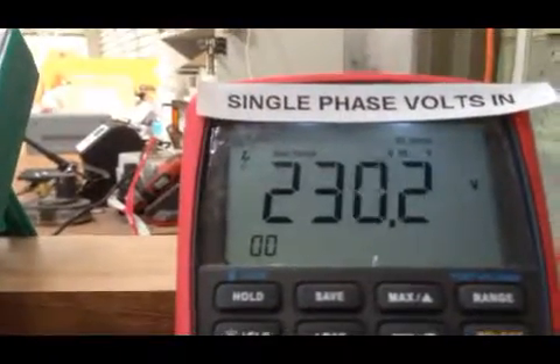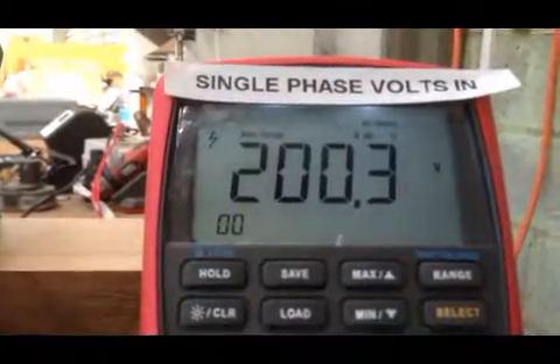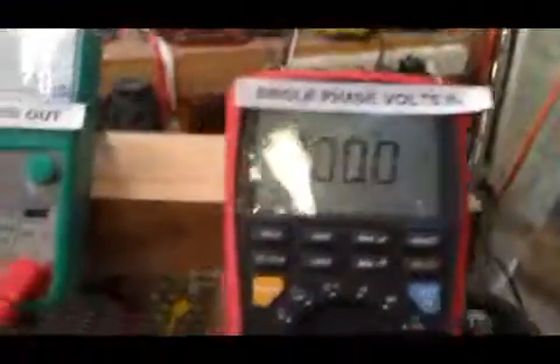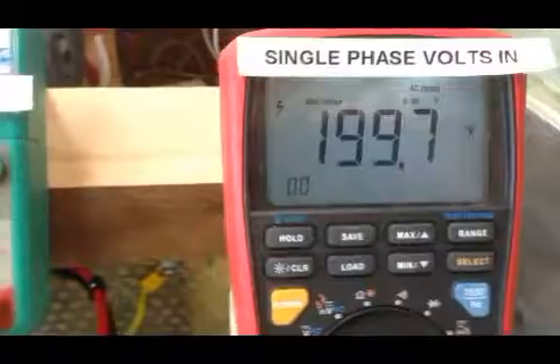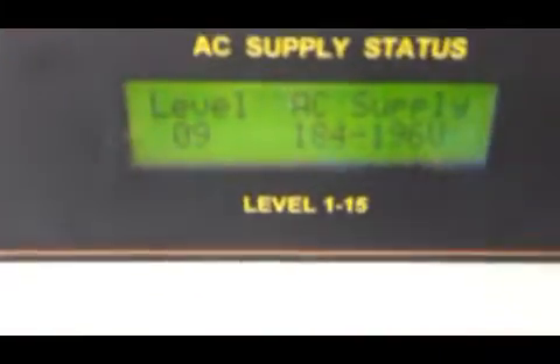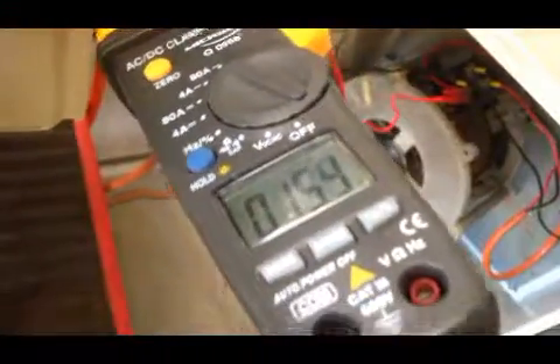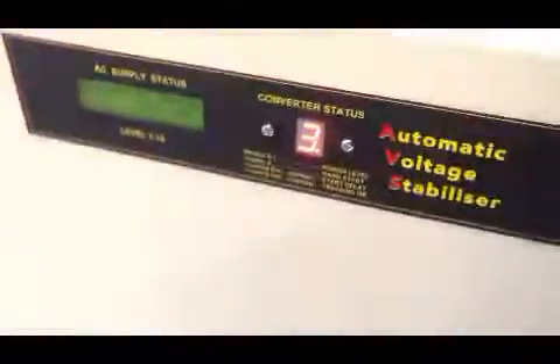Now I'm going to bring the voltage down using the variac. Pulling it down to about 200 volts — which might happen if you're loading a line with poor cabling. We've got 200 volts coming in now. Normally a standard rotary converter or anything else would lose a ratio of about 1.7 to 1, amounting to probably over 50 volts of drop. In this situation the converter's showing just a couple of volts difference, still running at level 7. Input current has gone up because mains voltage has gone down, but the output is still just over 400 volts and the machine's still operating perfectly well.